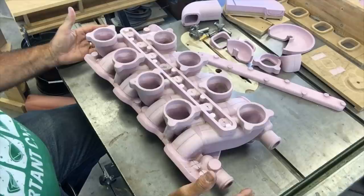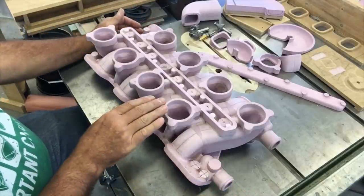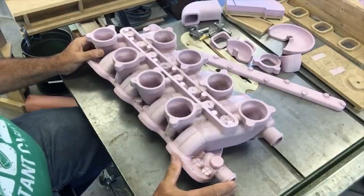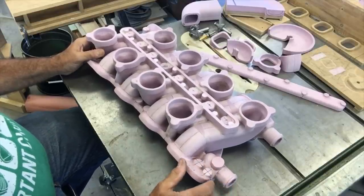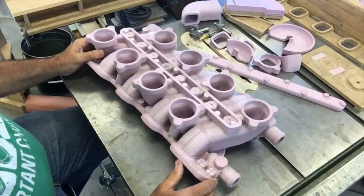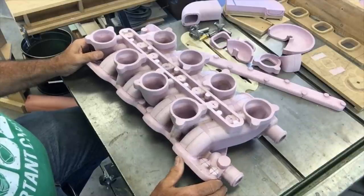It's about 22 inches long, about 11 inches wide, four and a half inches tall. I expect that the raw casting will probably weigh in the mid to high twenties — 25, 26 pounds, maybe as much as 30 — and with the feed system and a generous pouring cup, there could be another ten pounds on top of that.